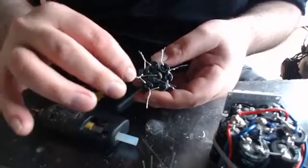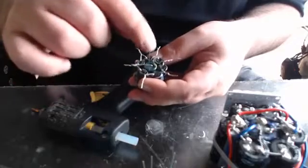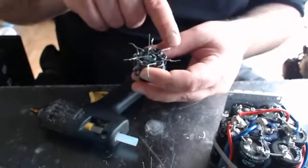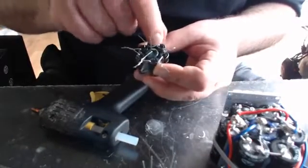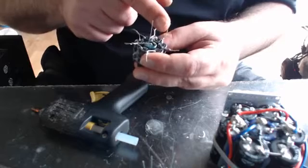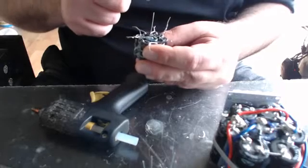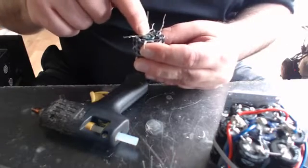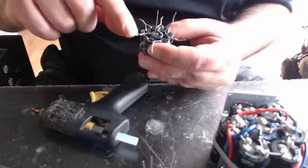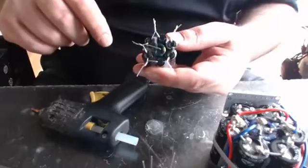So now the negative is plugged to the negative. This is going to be our new load. This is actually a positive, but we're going to use it as a negative. And we're going to go right here where the two positives are connected together, and this is going to be our new positive, the real positive of our load. So we're going to plug a light there. It's going to go out from this, pow, light up the light, return here, and charge the cap, because the cap is now plugged also in parallel to the system. It's that easy, okay? That's the basic of the SFX configurations.